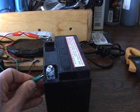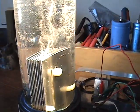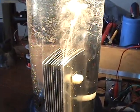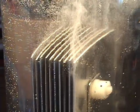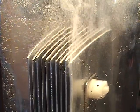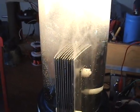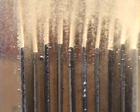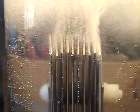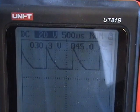We get a nice radiant spark here. It's drawing 300 milliamps at 52.5 volts input, filtered tap water, no electrolyte. These plates are not special — these are just regular 316 stainless plates. They've not been conditioned in any sort of way. Here's our voltage: 65 volts at peak.